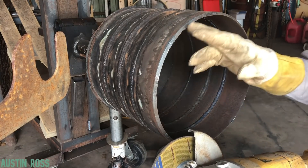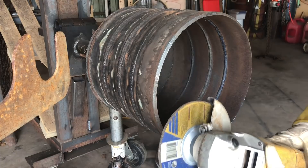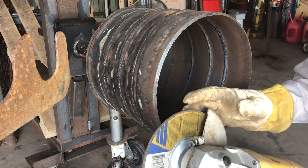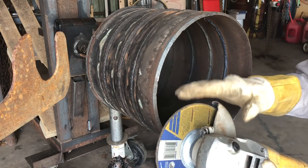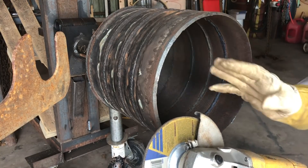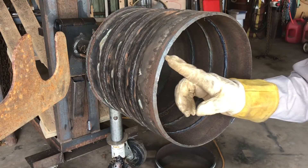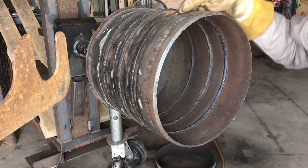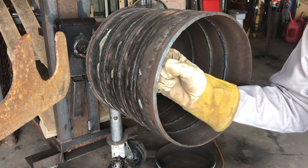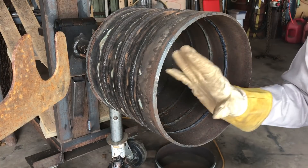The first thing you want to do to a bevel after it has been cut is put a landing on it, then brush it. I like to put a landing on first because once you put the landing on there's going to be a little lip on the inside, so you'll need to brush after. For downhill welding you usually want a landing anywhere between a penny and a nickel in thickness. What the landing does is give you something to weld to — without a landing you've got two sharp points and you're pretty much welding on paper.